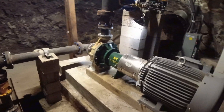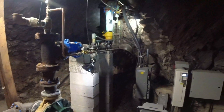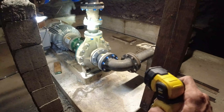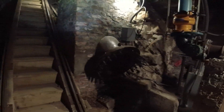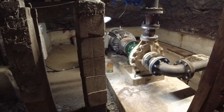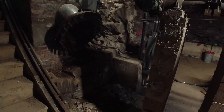Pumping along, moving water - that's what we do. Let's head back up top and check the water meter. Here's our discharge line going up. So there's our pump suction coming up, discharge check valve, flow switch, water line comes up and transitions to the HDPE, and from there goes all the way up the shaft. We're good down here. Unfortunately it's just that breaker and I don't really have anything to show for it, but I'll train the operator to check that next time before they call. Let's head back up to the top and check the flow.